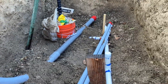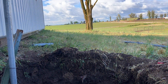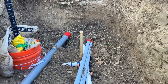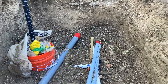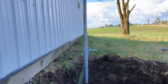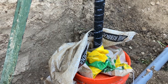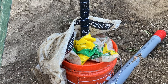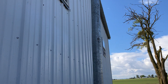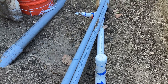You can also see the water line here. The plan will be, if the barn gets done at a later time, to take this trench and just extend it — we already have all utilities ready to tie in easily. You can see here this is a frost-free hydrant that allows us to get water year-round without anything freezing. We put pea gravel in a five-gallon bucket area, and this drains out whenever you shut the hydrant handle at the top, so that riser drains and nothing freezes. There's also a drain for a future irrigation valve.